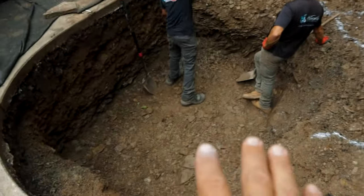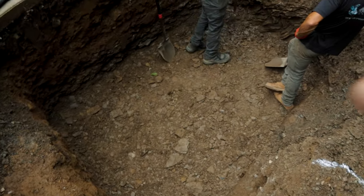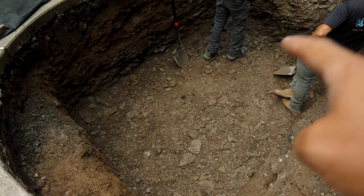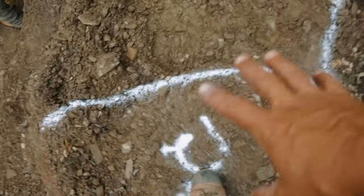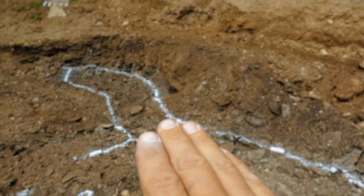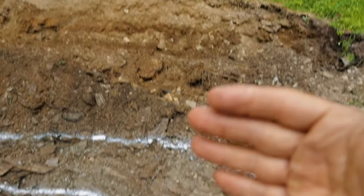We've got our wetland excavated down to the level we need to be at. Right now, Boley and Joe are just cleaning up the edges. This was all really ground-up shale — not too bad. We actually got the level that we needed. We've got to dig our trough for our centipede and snorkel in here, which might prove to be challenging. I've roughed in the rest of what the pond shape is going to be. Right where I'm standing, we're going to be about 12 inches below water, which is about the same as the top of the wetland, and we're going to go about 15 inches here — that'll carry all the way around on the backside. This is the shelf where we'll be setting a lot of our boulder work that's going to be creating the waterfalls going up the hillside, so we've got to make sure this is nice and stable with a good level surface.